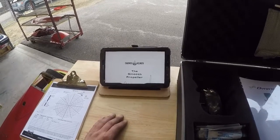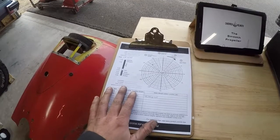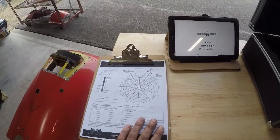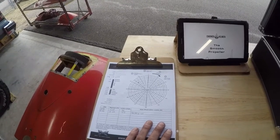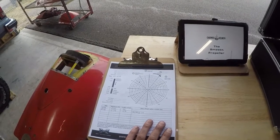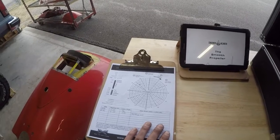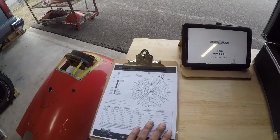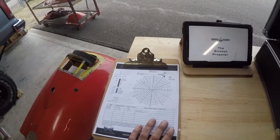It tells you how to take readings, how to set it up, how to use the chart for working out where you need to put weights and how much you need to add — whether you've added too much or in the wrong location. It also gives you all of the guidelines for how you install the permanent weights, what positions they can be installed in, what clearances you have to have, and also what the maximum weight you can have in one location on certain sized fasteners.